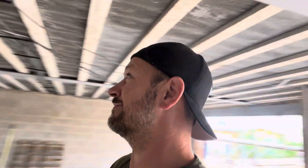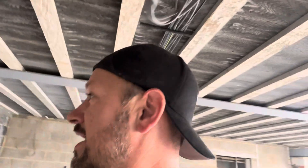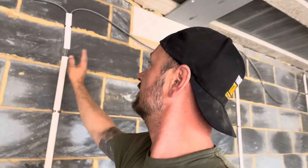I like to run cables, but I couldn't just do one run - I've had to do other runs as well, like to go to the underfloor heating and the air source heat pump that's going there. Little things - I didn't bring enough kit. This is a 4mm circuit because it's got sockets going up here which will be like a worktop area, so I haven't got enough of this and that's going to have to be replaced, but we're getting there - that's the main thing.